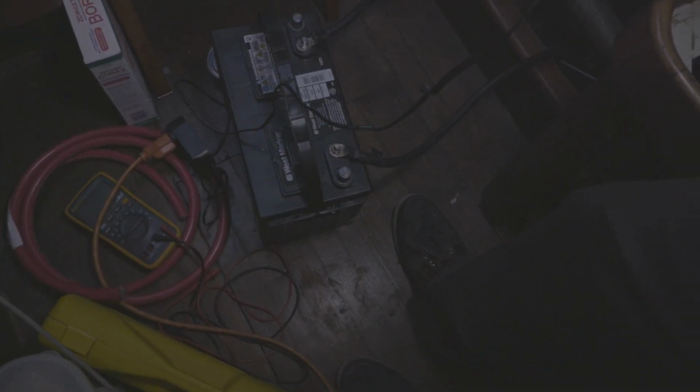As you can see, the cables don't indicate red or black. The previous owner didn't put red on this end, and it kind of took me a while to figure it out. This is the positive cable here on the side closest to my leg. And at any rate, he didn't put, like, some shrink tube or something around it. That would have been a good indicator that it was a positive cable, and you don't want to get your battery cables backwards, that's for sure. But he did put it on the other end, which hooks to the starter solenoid, so I did finally figure it out.